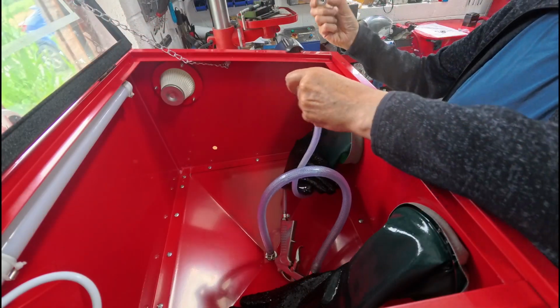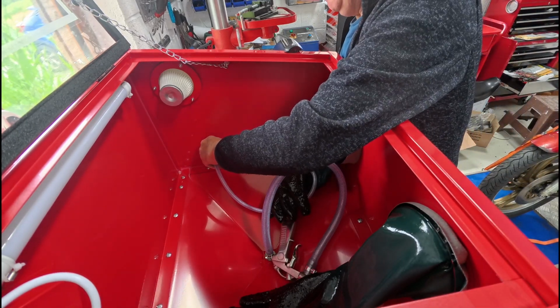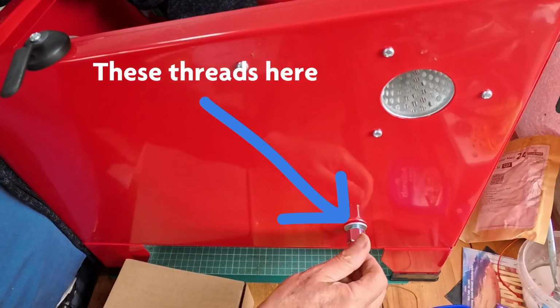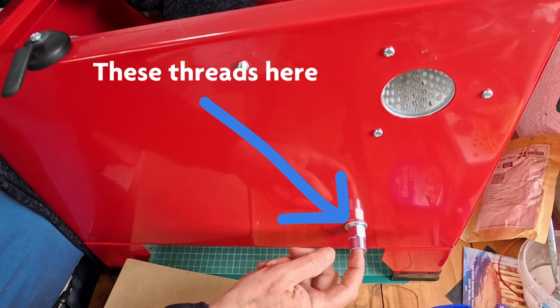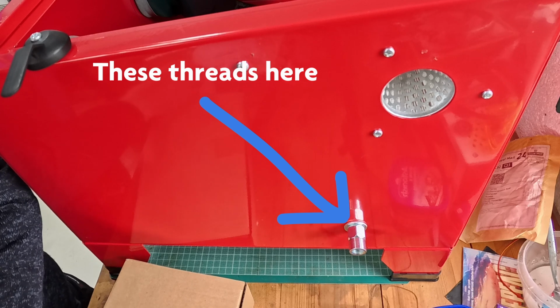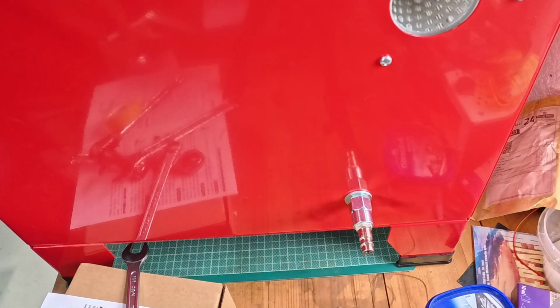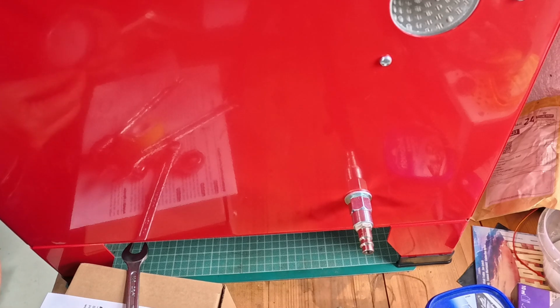Now it doesn't come with a compressor quick release fitting, so make sure you have one that fits your air setup. Here's where I made my rookie mistake number 1. I forgot, or I didn't, put PTFE tape on the threads, and you'll see that backfired later. Classic. I salvaged a fitting from another neglected air tool, you know, the ones you bought thinking you'd use it weekly, and this time taped the threads like a proper grown-up.